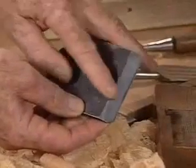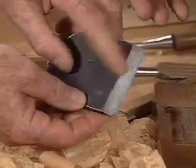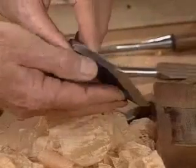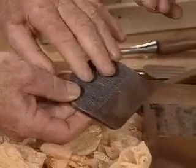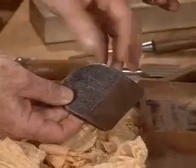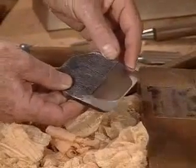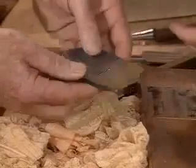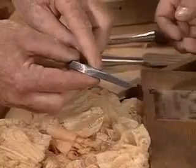And what is it? What's the material? And that's then the blacksmith forge welds that to a backing material. And in this case, it's wrought iron, which is just a no carbon iron. So it's very tough. So you're combining the toughness of the iron with that hard carbon steel there. Yeah, that's correct. And it also gives mass, and you can see these blades are much heavier and more massive than a Western iron. So they're their own wedge.